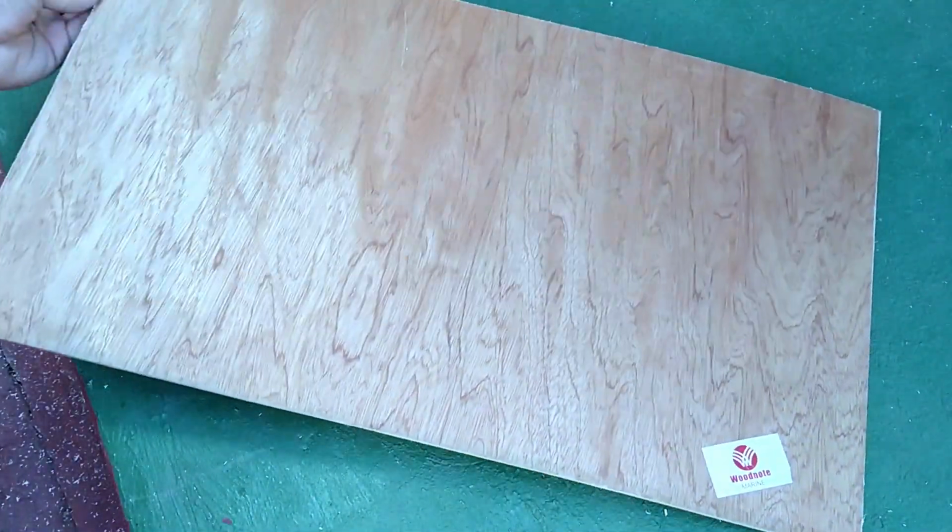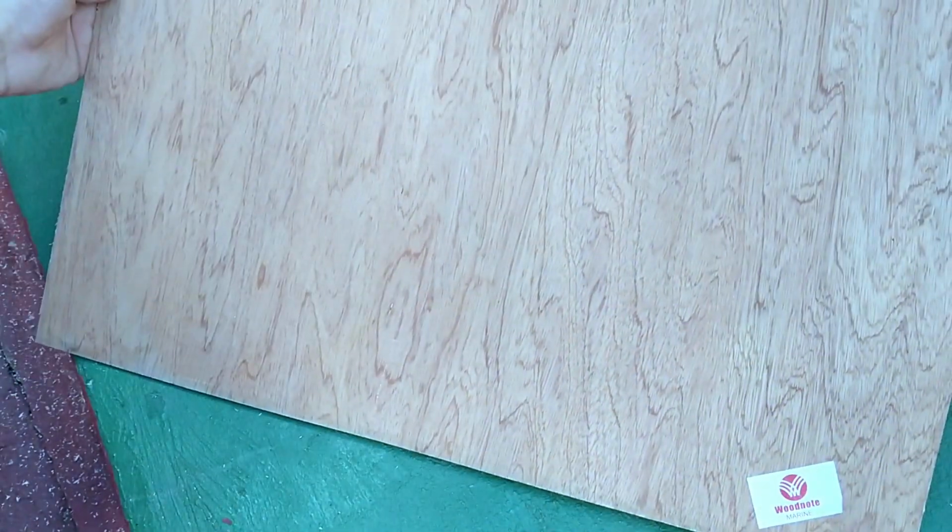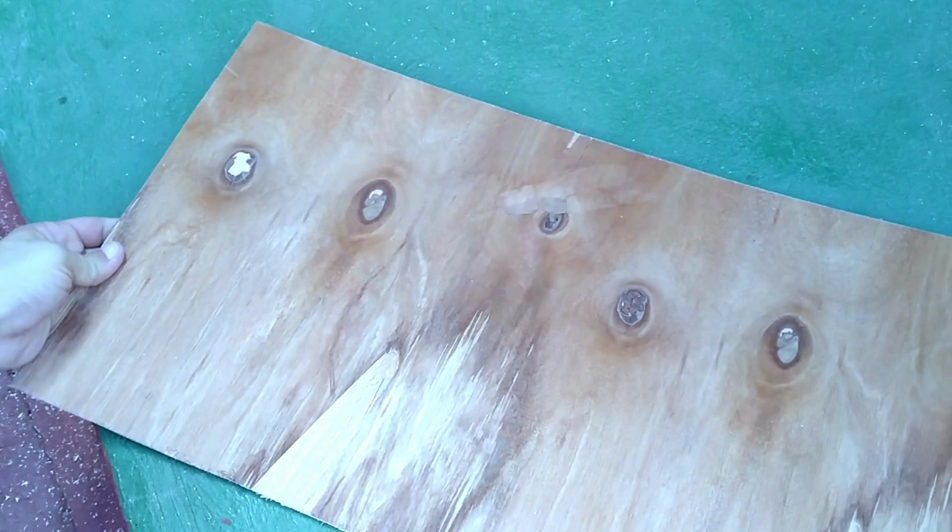But like many DIY projects, there's always a final hitch. I discovered that the midsection of the left wall is still not leveled enough with the right. But I can't just add another whole layer of plywood because if I do, the top and bottom sections will become so much thicker than the right wall. So a workaround is to cut another piece of plywood, but this time, only big enough to cover the midsection of the left wall that needed to pop out some more.